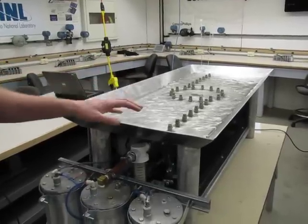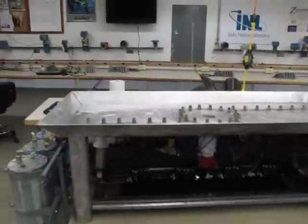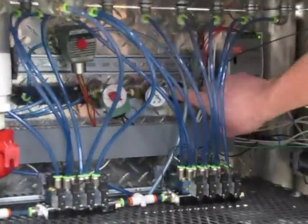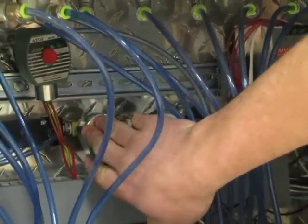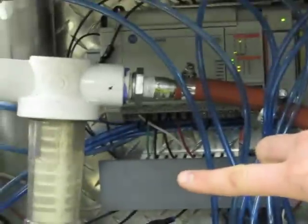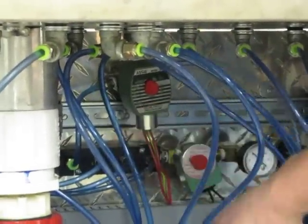What's going to happen is this whole thing is going to run until it runs out of water down below, and all of a sudden it's just going to automatically start refilling. The first thing that happens in the refilling process is we shut off the air from this solenoid right here. There's a regulator right here and we usually run around five. This solenoid shuts off the air, which then opens this valve, and since the pump runs all the time it sends the water towards the tanks. But we have to get rid of the air already in the tanks through our vent line.